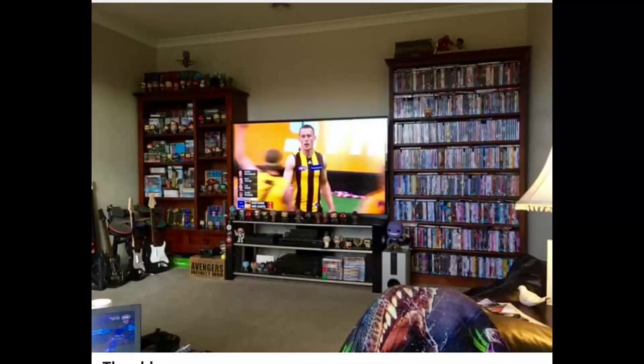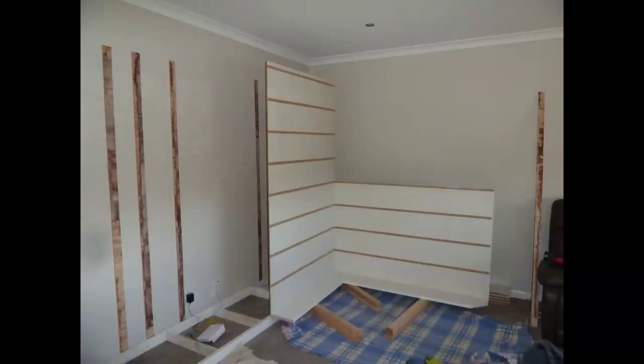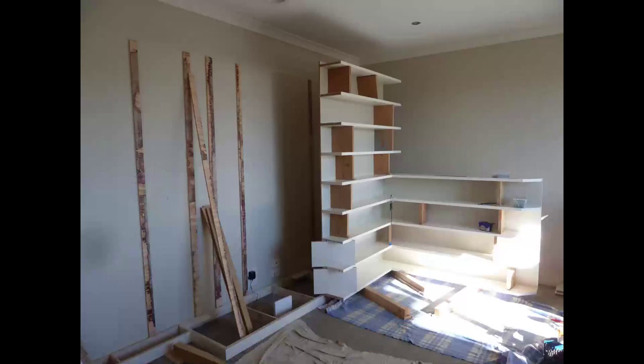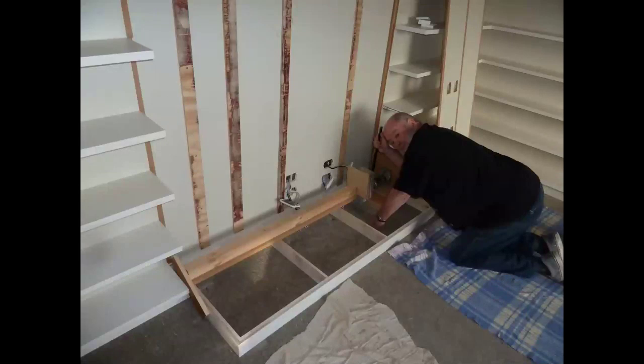And he says, my daughter asked me to build a DVD floating shelf unit. There she is helping dad. And I thought you could show it on your show sometime. All 25 millimeter MDF. I sprayed it with two pot paint. The corner units I screwed from the back. The center unit, I used biscuits, pocket holes, and mini top clamps. So there's John down on the floor with a jack, winching the whole unit in.